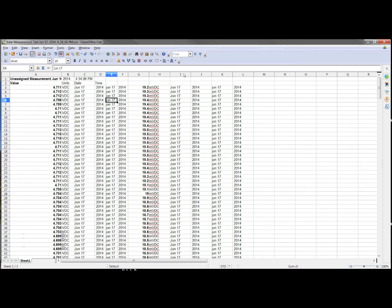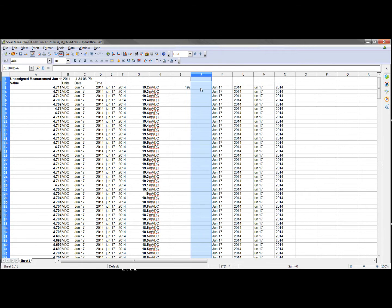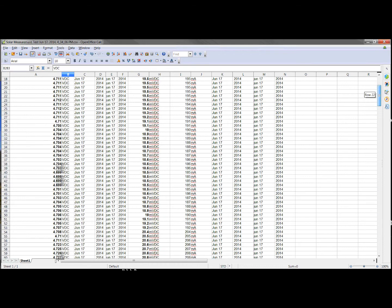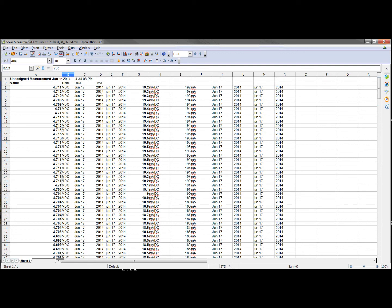The problem is this is power, so I have to know voltage times current. This is across a 0.1 ohm resistor so I can do a quick calculation — times 10 and I get milliamps. But look at that — it looks like I have less data from one unit than the other. I've been taking data concurrently, or what I thought was concurrently, and one of the sampling rates is different than the other. I went through and I couldn't find a way to check sampling rates or include a proper timestamp in the app.